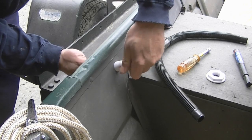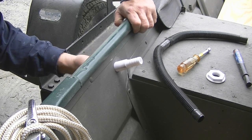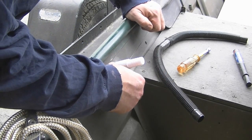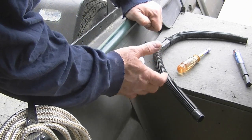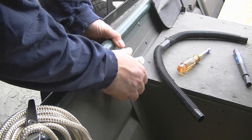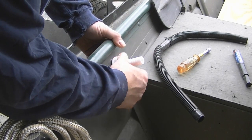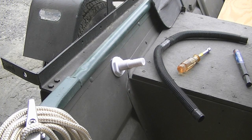I think I might get the black version of this through-hull fitting — it's a little bit shorter. It's like six bucks on Amazon. So there's our fitting. You've got to make sure you clear this lip with the nut because you don't want to overlap it, otherwise you're not going to get a good seal. You still have to seal it with some sealant. When you screw it down, you've got to make sure you clear this piece of metal so that you're flat up against the hull — we clear it by about a millimeter or so. There's our through-hull fitting.